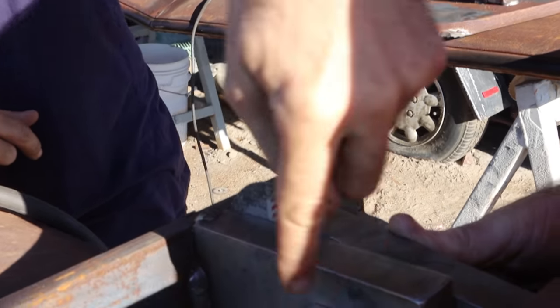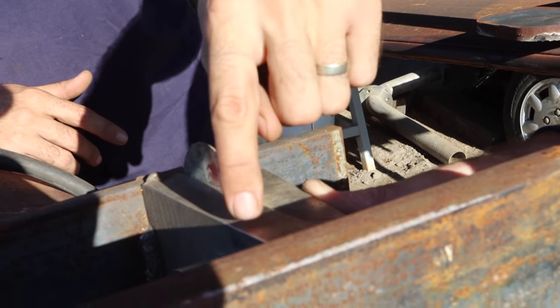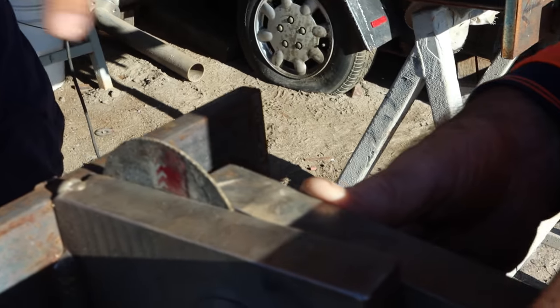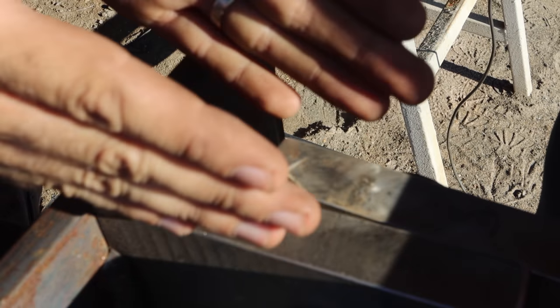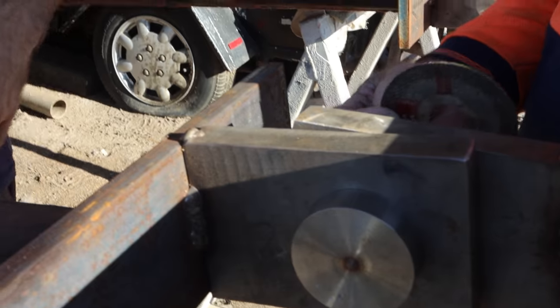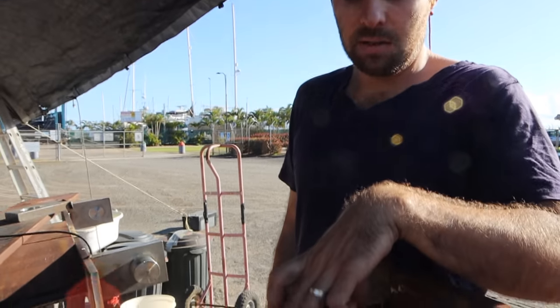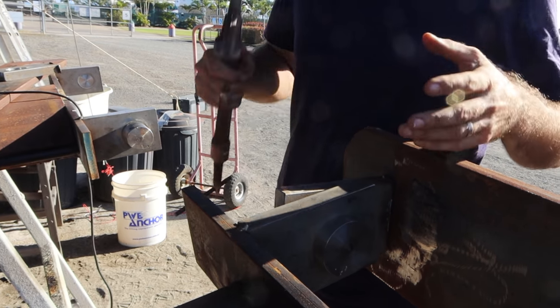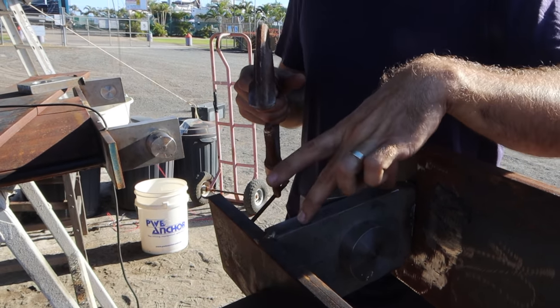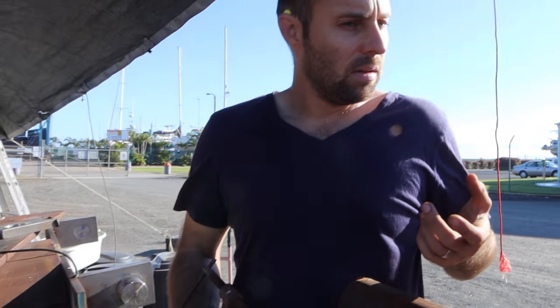Originally this part of the hinge used to be on this side here. By moving it over, when the wing is travelling backwards, this touches this and works essentially like a thrust bearing in an engine or gearbox - it doesn't allow the wing to go any further, controlling movement in that dimension. We've got three of the four hinge plates aligned; we just need to figure out the alignment for this loose one. We're thinking we just clamp it to the one we know is aligned, put a tack on and see if we can roll it.